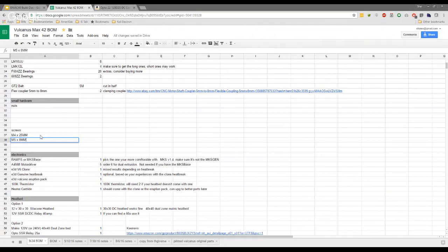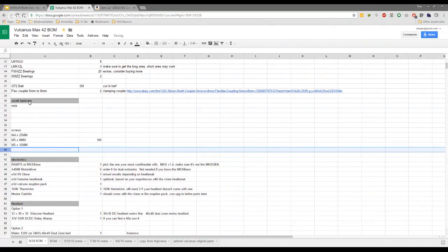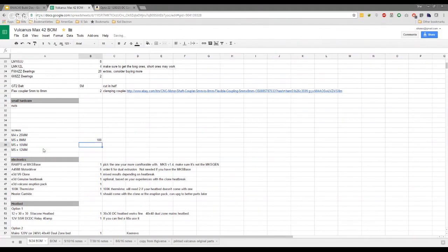Yeah, I'm the same. What I would say is quantity, you want 100 M5 8s and anywhere around 10 to 20 of 10s and 12s, I think. I would only disagree and say 50 just to have extra. The cost difference is maybe a dollar or two. Yeah. Get more than you need, guys. It's the way forward when it comes to your bolts and your fixtures. You never know, you might print other parts from Thingiverse that need M5 12s. To be fair, I think I probably used about 3 or 4 of them, but you don't want to want them and then not have them. And they're not expensive if you're ordering from Ali or eBay.